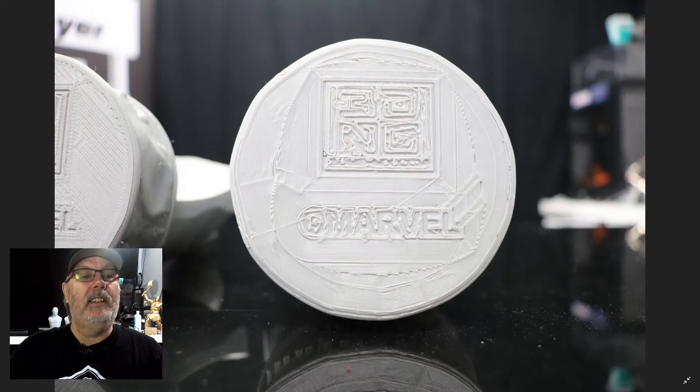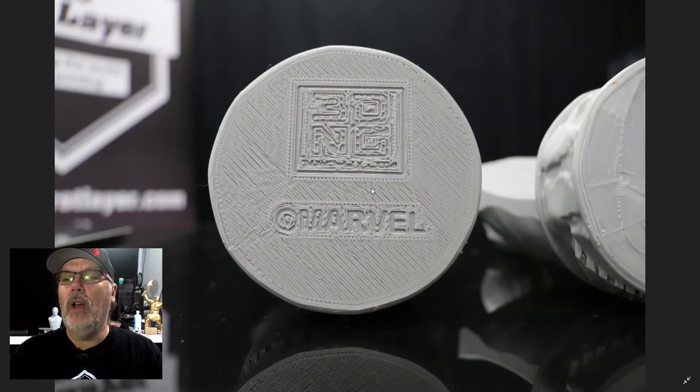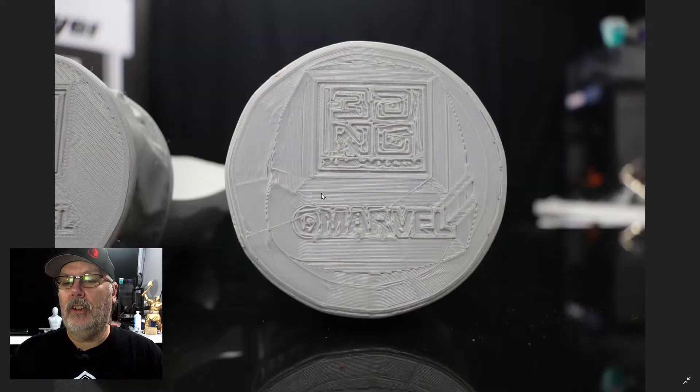On the bottom — this is a telltale sign. This is the first one we printed. We can see that it looked like it did one area and then it changed direction and started going in a circle, which was kind of strange. The bottom on the first one is not that great. On the second one, we do have a much better bottom — it's a lot more defined. The lines are going in the exact same direction. It did not over-extrude as much as I wanted it to, and that's a telltale sign of the gaps that we're seeing. This could also be that my nozzle is a little too far away from the bed.